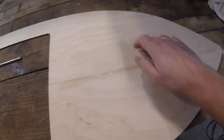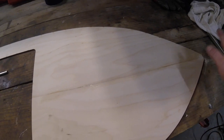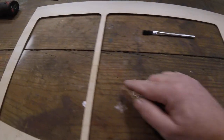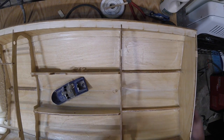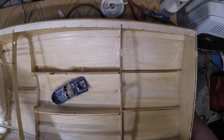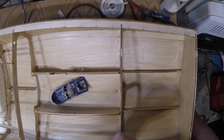If you'll remember our top, which is cooking over here on the other bench — I already started sanding it. This is the bottom side here; you can see the epoxy seam. Sand this down. Try not to sand it out because that defeats the purpose. You do have to sand in that crack, but try to be gentle — this is a real fragile joint. That way it lays nice and flat on the boat when we go to put it on. I usually sand with an orbital, 60 to 80 grit — just knock it all down. The rougher the grit, the more porous you make the wood, and the better it's going to adhere to everything.